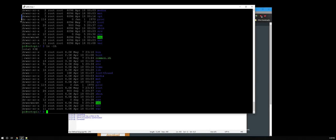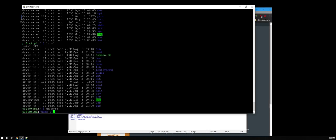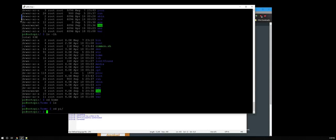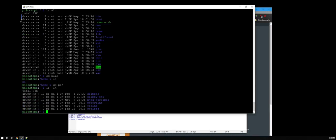We want to go back home, so we're just cd home. But we are not in the pi directory. So if you look here, see there's a pi directory that comes automatically. So we need to go into the pi. If I hit p and i then hit, I'm sorry, not colon, tab, it autofills it in. Now, there is our Klipper install along with OctoPrint.